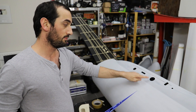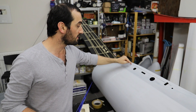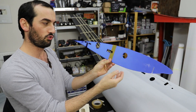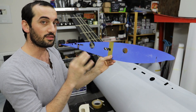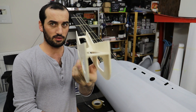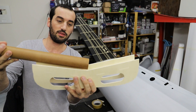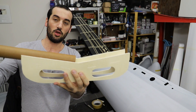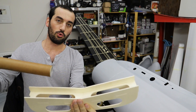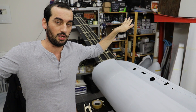I just got the main spars in the fuselage. At the time when I made the mold for the fuselage the wings were not done yet, so I made a channel in there that I use now to align the wing. With this I could align both sides 100% with exact cuts for everything. I made this bracket — this will go inside the fuselage — and the wing bar is 40 millimeters aluminum. This main spar will be cut in half and mounted one on each side, glued and reinforced with carbon fiber to strengthen the whole wing box.